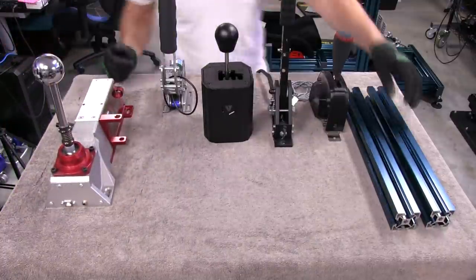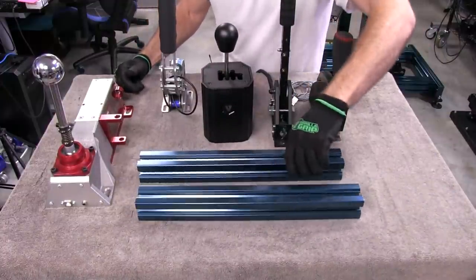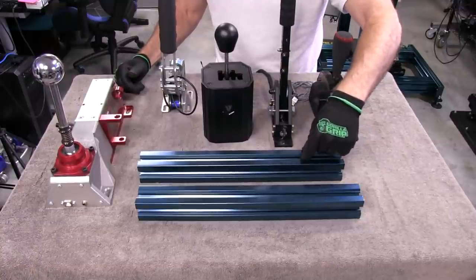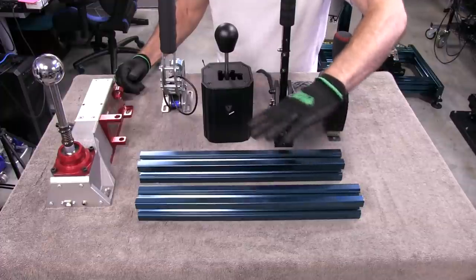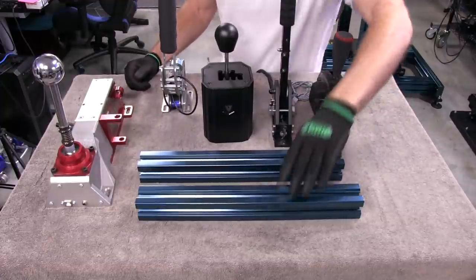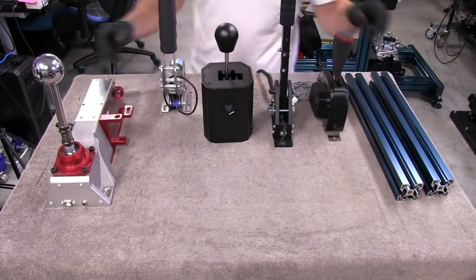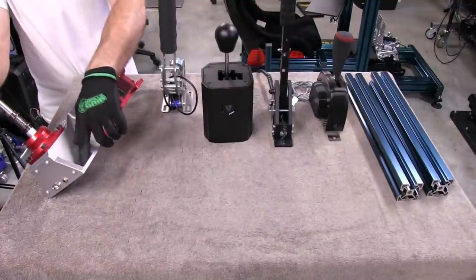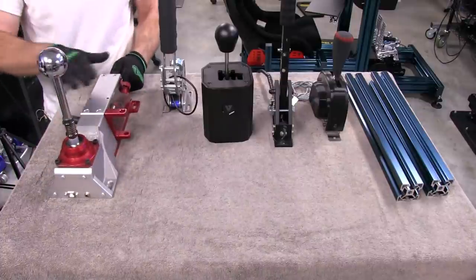So it's pretty easy what we're going to do here. When you get the Pro Kit, they give you some 6mm spring ball T-nuts that go in these channels, of course, and some M6 bolts that will go into them. So you can mount whatever you want, however you want. I'll be putting the spring balls in, and then it's a very simple matter of running my M6 bolts in here. I use little washers and hex heads and get this securely attached.